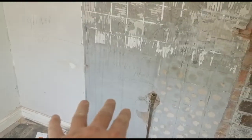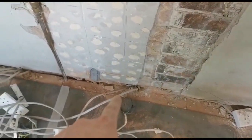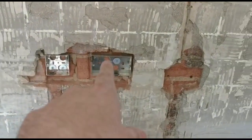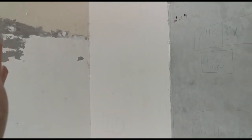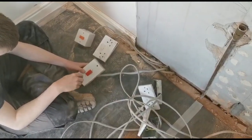We've got a double oven and microwave going in here. What we're going to do is extend the ring — there's two ends of the ring coming in here; it wires from the fuse board to every point and then back. We'll get a cable from here, up to pick up a socket up here which will do the microwave and the extractor. Then back out, along, down, pick up this one and link over to here which will do the plinth heater. Then back out, around, to pick up this point, and it goes back and attaches onto the other cable coming up. We've also got six mil to bring up for your double oven — we'll leave the cable long enough to come out about a meter from your cupboard so you can work on it, then pull it back after the kitchen's fitted.